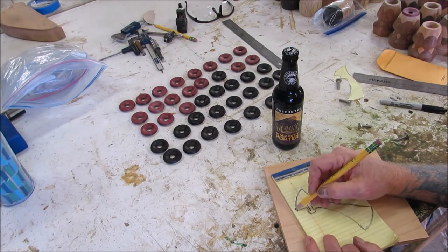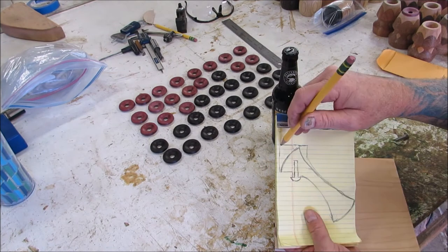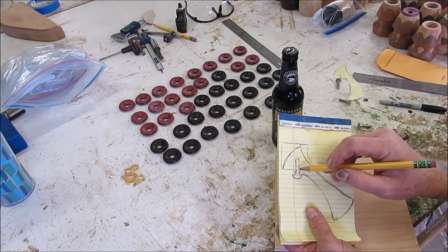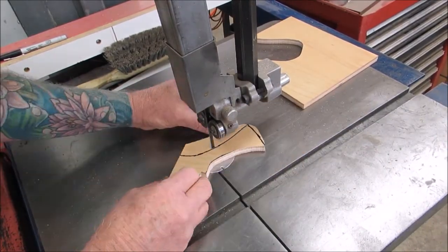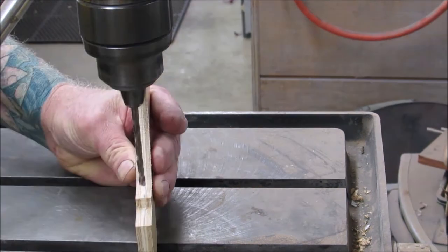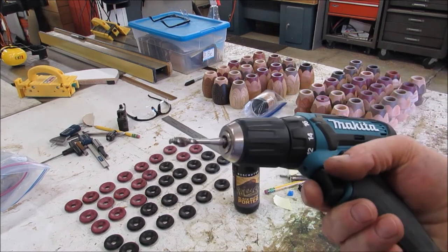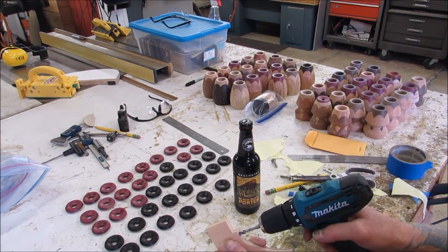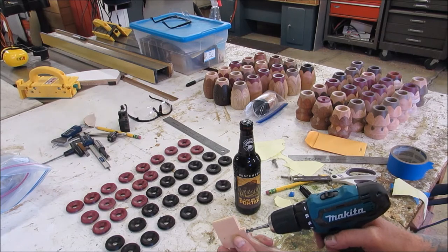I'm going to cut out a pattern that's square on the top like that — a pattern where I can cut this out first, and then I can use this edge here to put in the drill press or the mill drill to get a straight hole in there. I'm just going to rough drill a hole in this just for the prototyping. I've got a spiral fluted quarter-twenty tap on here. You can easily tap a lot of dense hardwoods — Eastern hard maple taps okay. This will work.